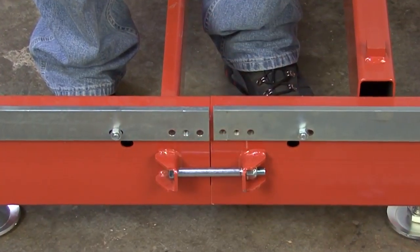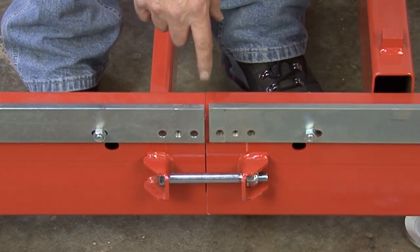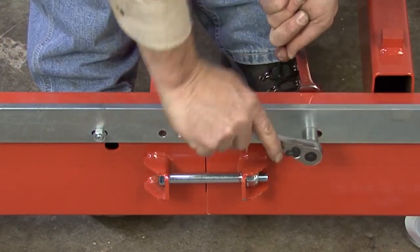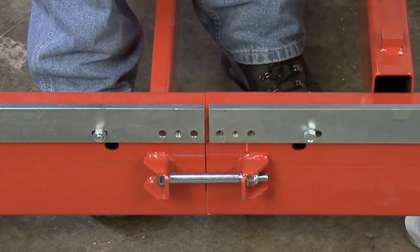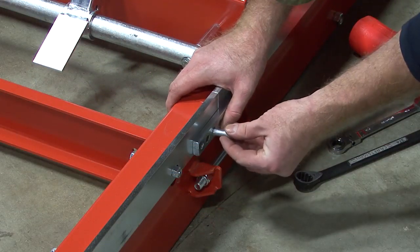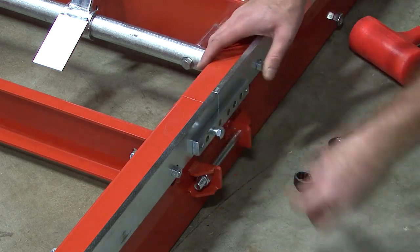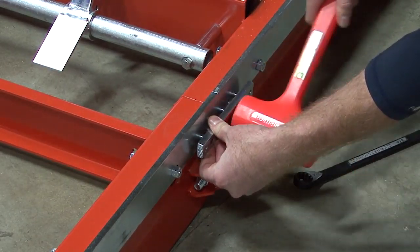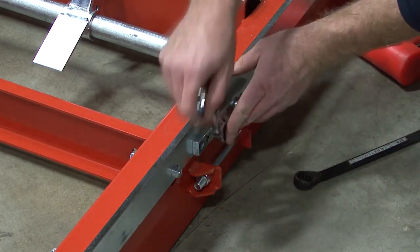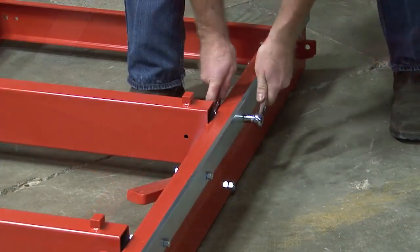Next, install the main rail coupler. First, make sure the rails are tight against each other. If not, loosen one of the rails so that it will slide — loosening the eight bolts that hold the rails onto the main tube will allow this adjustment to be made. Then install the connecting coupler using two hex head bolts. Gently tap the coupler using a rubber mallet to start into the holes provided. Tighten the hex head bolts evenly until snug. If the rail was loosened, retighten those eight bolts at this time.